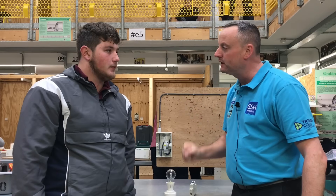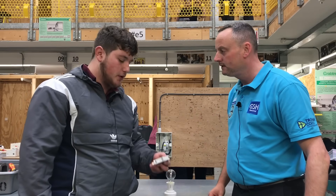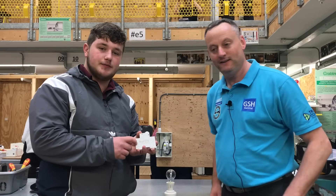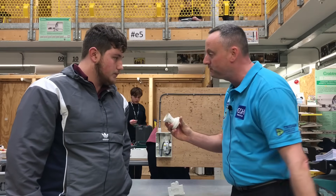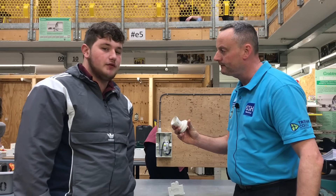Since it's a domestic lighting circuit, the size of the fuse that goes in the consumer unit will be how many amps? It's a 6 amp, and it's 2.3 newton metres of torque — it says so on the side. We've got this style of lamp holder going on and we've got two pins in there. Can you tell me which one of those is live and which one's neutral? It doesn't matter because they don't have any polarity.